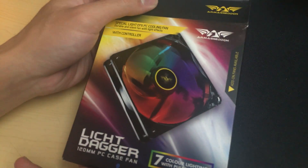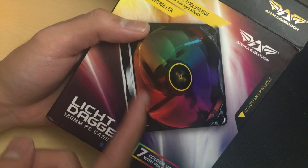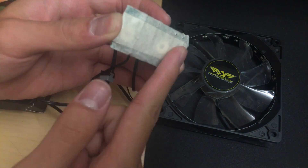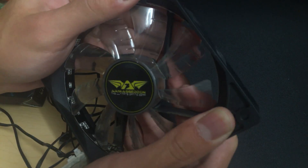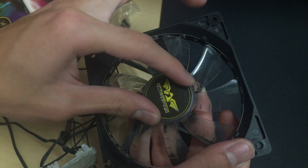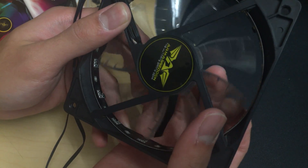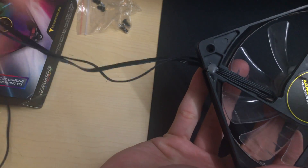Permageddon Lich Dagger fan. The box is crappy with misleading and wrong specifications and a misleading photograph. Accessories are just screws — black screws, which is not bad, but also silver screws. The mounting screws for the controller I taped up to prevent shorting, which is an oversight. It has a button to color-change the fan. The fan itself is surprisingly sturdy — it flexes a little — and the fan motor is surprisingly sturdy, although the bearing is not good and doesn't spin very well. Normal four-pole two-phase motor. Plastic transparent blades, nine-bladed design, looks more like an airflow design. Ring of LEDs on the side but no rubber corners. Black cables, so that's not bad, but there are too many cables, especially for the controllers.